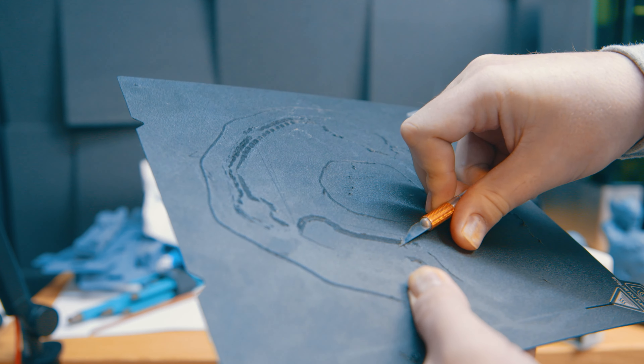For what I want to do — my use case is printing incredibly small layers to get the most detail and have the least post-processing cleanup — I'm so happy that despite a bit of stringing I'm sure I can fix, I can print at 0.05mm layers and print anything from miniature scenery to cosplay props. Unfortunately the build plate is still too small to create a cosplay prop that would fit my son, but if I'm able to slice it down it'll work absolutely fine and I'll get incredible, and I would say up to this point unrivaled, detail. So if you're looking for a stable, really high detail, easy-to-use machine that gives you the opportunity to tweak and tinker to the nth degree, then I would highly recommend this printer.